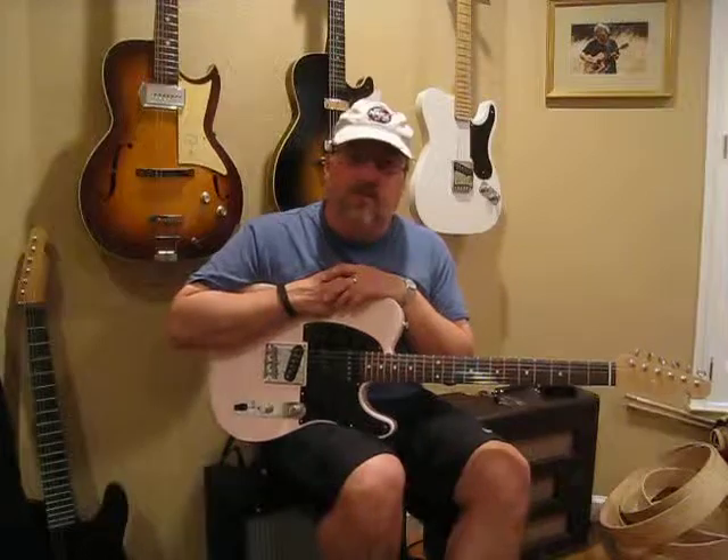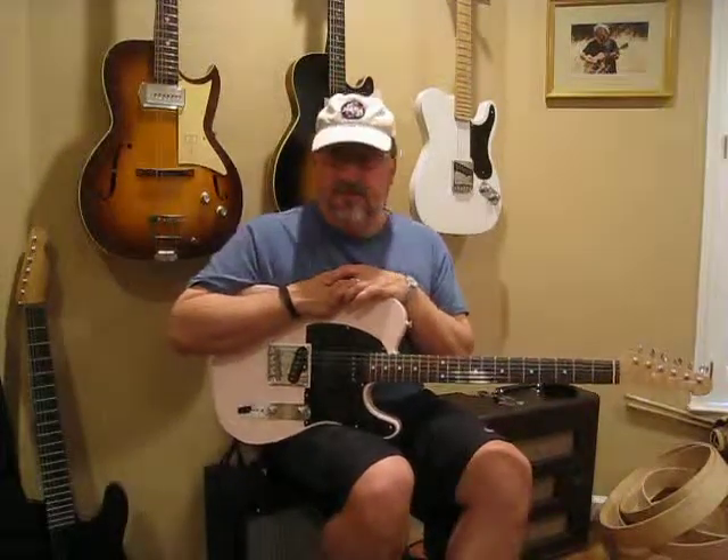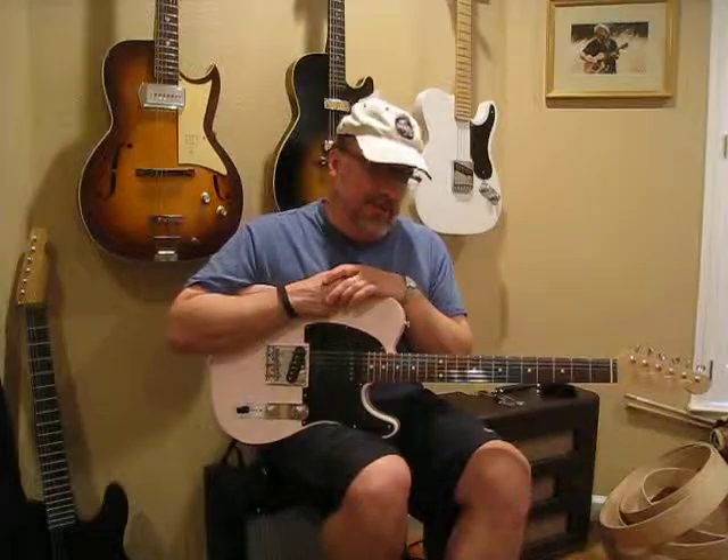The next development will be extremely interesting. I'm going to try and exactly replicate the coil forms in both Tele neck and bridge form factors — the coils will be a little wider and a little squatter, and I think that will push the inductance up. It does really interesting things to the front end of the amp. Have a great day, take care now, bye-bye.